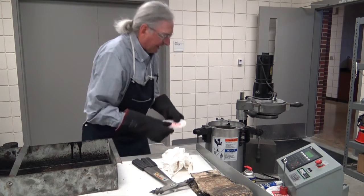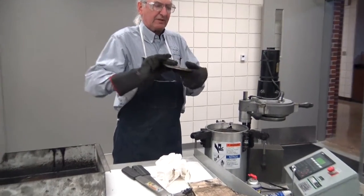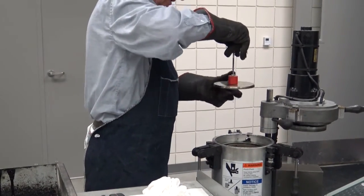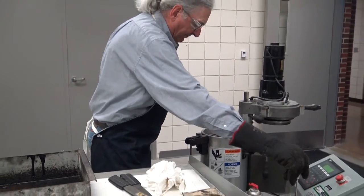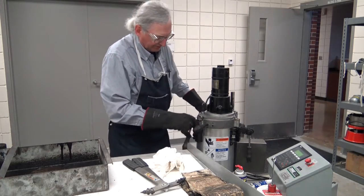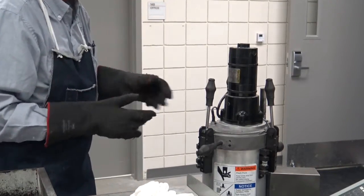Now we put the top paper in, and we're going to have to put a plate on top. With this particular device, it has a special plate — you'll notice it's beveled. The one on the bottom is sitting like this; the one that goes on the top is sitting with the bevel up. The flat side always goes towards the sample. Gently lower that into the sample and snap off the magnet. Swing the head around and drop it into place — you'll notice these ears line up with these hold-downs. Put all the hold-downs on because this has got a hydraulic ram that comes up from underneath and applies 600 kilopascals of pressure.